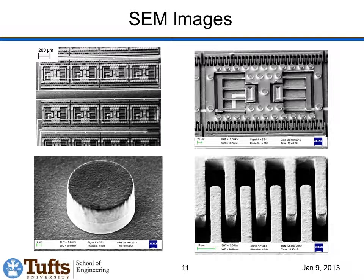Here are some microscope images of the sensors. You can see the array on the top left, an individual element on the top right with the bumps on it, and details on the bottom showing one of the bumps and the comb fingers. One of the critical features is the comb finger gaps — these need to be parallel with no shorts across them, making this a critical part of the design.